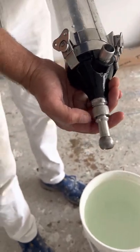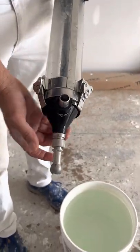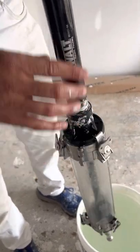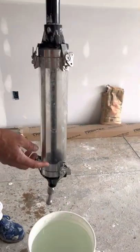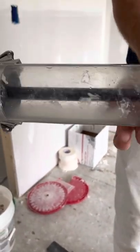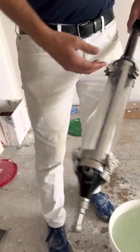As we're running the angles, sometimes they'll be a little heavy. If you're running your mud too thin, it comes out too fast and you might have to go across them again. You just close this up — when you push on this it won't move, so it allows you to go back across the angle with the glazer. There are four holes in the top — this is a DeWalt brand but Level Five made this tool originally. You pour water into these holes while mixing your mud. That helps the plunger — it'll help it go up and down.